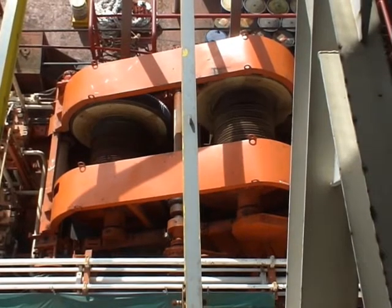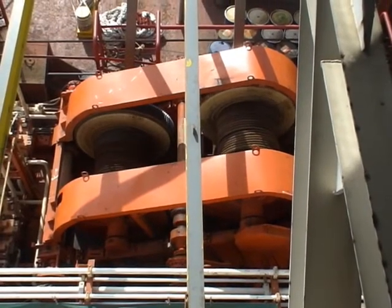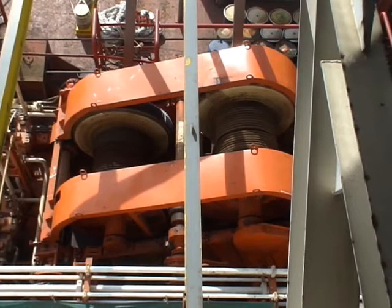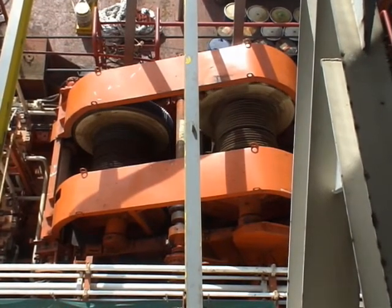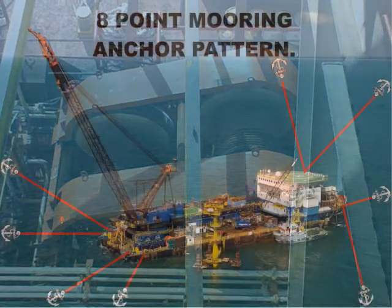After the pipeline has passed through the various stations to complete the makeup of the field joint, the lay barge moves forward one field joint, a distance of 10 meters. This is known as pulling pipe.